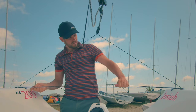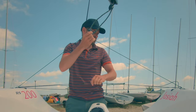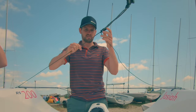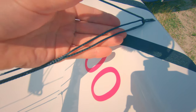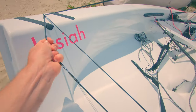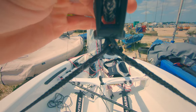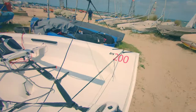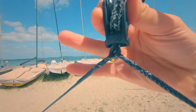There's your finished strop. You should have one adjustable splice on the starboard side of the boat. When you move this splice, it connects to both port and starboard strops, pulling on both equally to change the mainsheet block position. The adjustable splice leads across and then separates out into the two strops — one goes straight up the port side, one goes across the boat and up to the starboard side — giving you a neat figure of eight which nicely distributes the load so you won't pull your block apart.